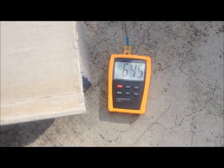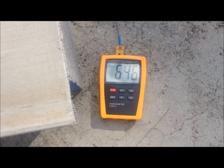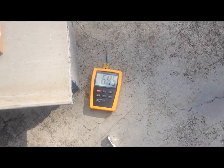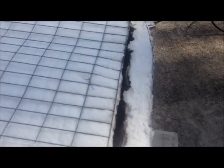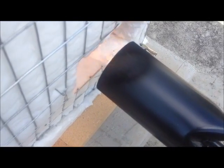I've been running for 2 hours and 38 minutes now, and I'm right up to about 645, just tipped 646 degrees. The wind has picked up a little bit, blowing the flame around. I did have to bump it a little bit. You can see I've got my draft open just a little bit further. Still in the carbon burn-off stage here. I did bump the flame a little bit — just starting to see a little bit of blue coming out, but still mostly yellow. I've got a lot of throttle left on this weed burner — 500,000 BTUs if I crank it wide open — and I'm a long way from that.